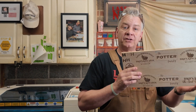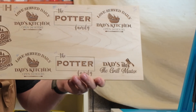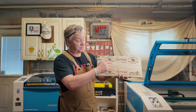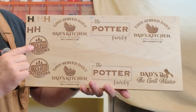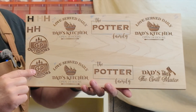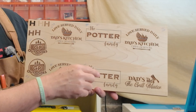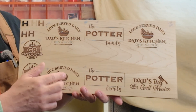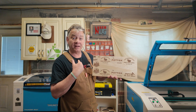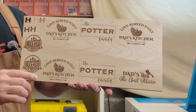I want to show you an example from the last few days. I've been running my maple settings — this is my last test board. Hopefully you can tell the difference in the shading of the brown engrave on each of these different designs. I can tell you this is much darker, more beautiful, rich kind of brown than this one. But here between these two, this one is the darkest and, in my view, richest looking brown. Very consistent, all of them — really nice shading, great consistent engrave. They were all engraving down to about 1.3 millimeters in depth. They were all run at the same speed, but surprisingly the darker colors are the ones at a lower power than the ones that came out lighter. Why?